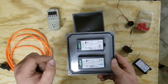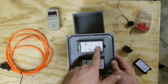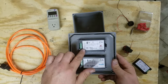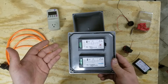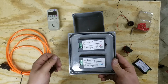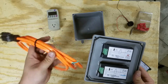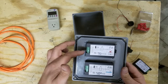Make sure you connect the current transformer in there and do not connect your 120-volt supply to those leads. For the bottom two screws, that shows as being connected directly across in parallel with your load — that's where you want to connect your live and neutral. It doesn't matter which order you have your live and neutral as long as they're on the bottom two screws, because these meters aren't sophisticated enough to know which way the current is in relation to the voltage they're sensing from the line. You'll hook both of these voltage sources up in parallel, and that's where the extension cable comes in — connect the live and neutral from the extension cable to both energy meters on the bottom two screws.